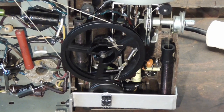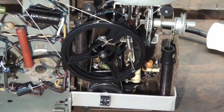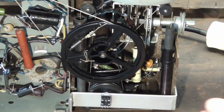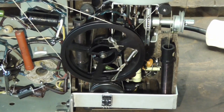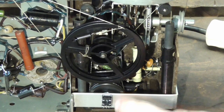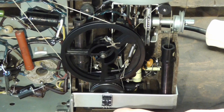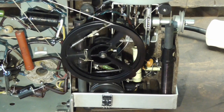Alright, I found a way that works. It's not the prettiest contraption, but as I said, it works. You can see I've even put a spring in here and I had to tie it to this rope because otherwise it would interfere with the coil here and rub on it, and well, that's not cool with wire that thin. But yeah, it does indeed work, and I've made myself a mark here on the wheel, which you'll probably not be able to see, but I use that to confirm that the thing does indeed make a half revolution, which is exactly what we want.